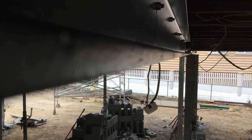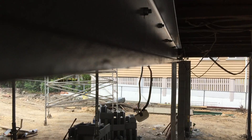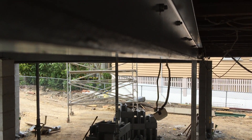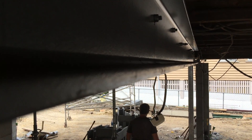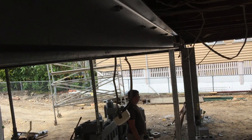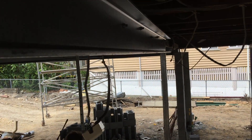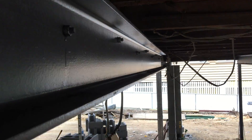That one's down. Going from this side to that side, there's now close on five to ten mil bend in that steel beam, which wasn't there before. So because of that, at the middle where it's 10 mil low, the 10 mil I've got the timber up means that we should be reasonably flat up there — reasonably level — which is what we're after.